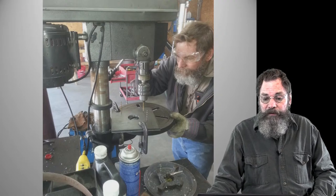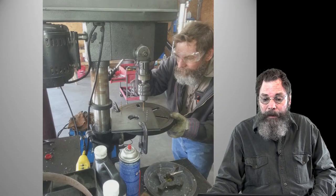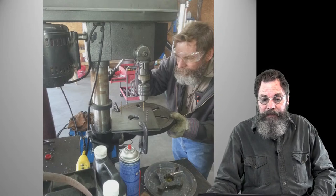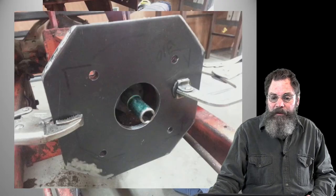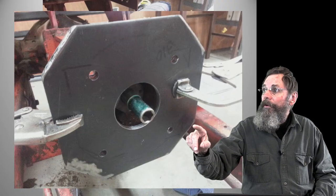So basically I stacked together the sheets of metal that are going to be holding the motor to the transmission, so the holes are exactly in line with each other. They're line bored with the drill press, and everything's clamped down, so it's accurate. You can see in this picture the result of that. We have the drawings, all the black marks there. The holes are all lined up.